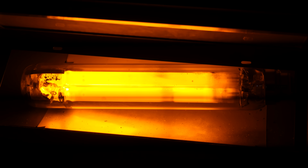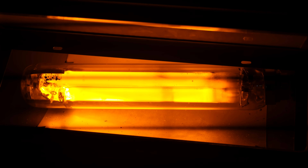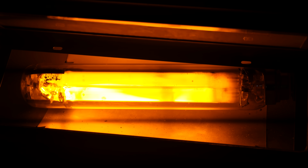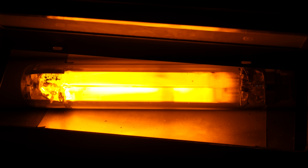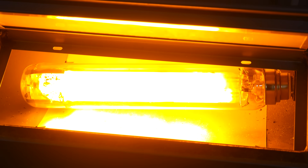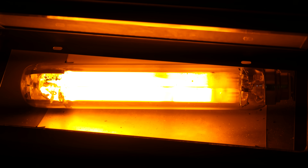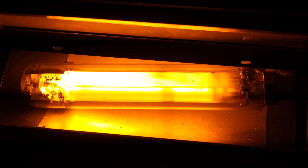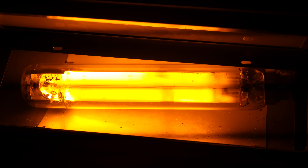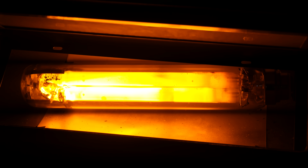What I was going to say was: while this has an extremely slow warm-up time from cold, they actually can do a hot re-strike, no problem at all. It's not good for it — at least they claim that to be the case. But you can see if I unplug it and plug it back in — there you go, it's lit. It doesn't need to cool down to start up again. It doesn't even have the slight delay of a high-pressure sodium lamp. So for momentary power outages or power interruptions, this is definitely better in that respect.